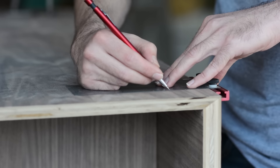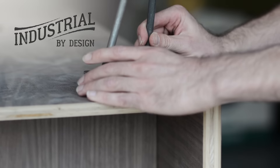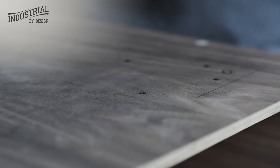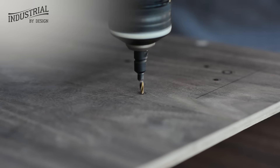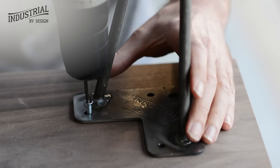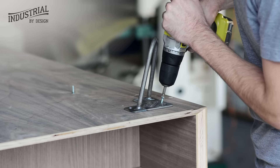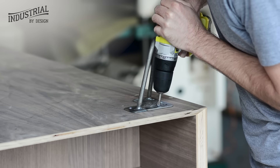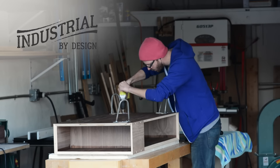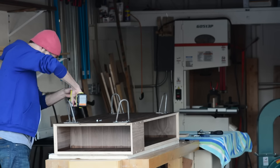With the cabinet out of the way, I turned my attention to the base. This is the first time I've used hairpin legs on a project, but I'd been wanting to for a while. When Industrial by Design reached out and asked if I'd try out one of their products, I jumped at the opportunity. These things are just about as easy to use as you'd imagine — set them where you want them, mark out the screw holes, pre-drill, and screw them in. The first thing I noticed is that they have a really confidence-inspiring heft; you know you're not using something cheap or flimsy. This is the 6-inch version in raw steel, but you can also get them with a satin black powder-coated finish in a variety of sizes. The manufacturer recommends putting some furniture wax on the raw steel for extra protection — you could also paint them any color you like. I'll throw links to the product and their webpage in the description. They're definitely a good alternative every now and then and great for busting out a project really quickly.